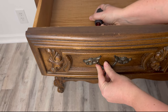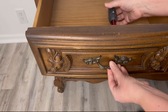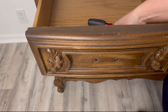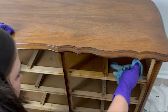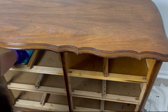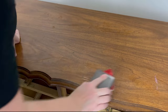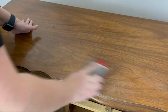To prep this piece, I'm removing all of the hardware and then taking all the drawers out. Taking the drawers out gives me a chance to really look at the piece and see if there's any dust or dust bunnies in those cubbies — and of course there is. So I vacuum them out and then use Dixie Belle's White Lightning cleaner to thoroughly clean the piece. I finish with a damp cloth to make sure I didn't leave any cleaner residue. While cleaning, I noticed some of the finish is chipping, so I take a little sanding sponge and smooth it out.